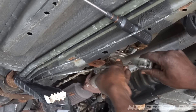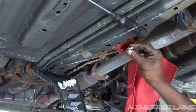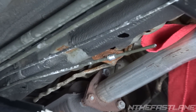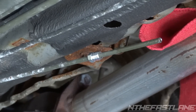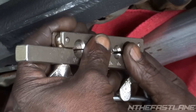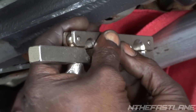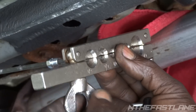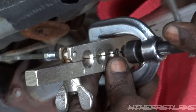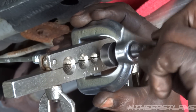He's going to clean out the tip a little bit first. Step one: put your fitting on there — this is the right way, you can see how the thread is facing where it's going to be flared. Next step: put your flaring tool on there, make sure it's flush. You can see where he put his thumb to make sure it didn't come past. Tighten it down, then put the flaring tool on and tighten it down until it bottoms out. That's pretty much done.